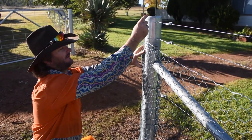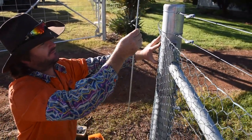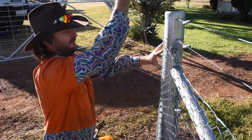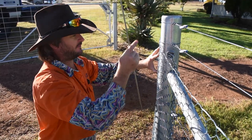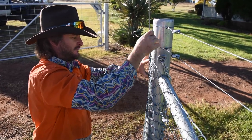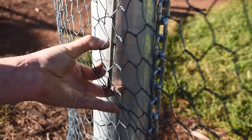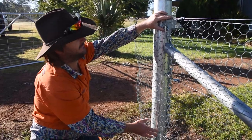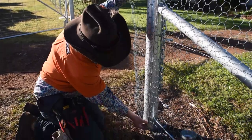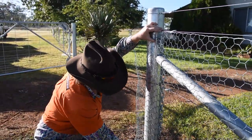We're going to get our threaded rod and Dave's pinned it up so the netting's flowing neatly. We've got a slight fall in the ground here so we're going to make our rod vertical, so it's not necessarily going to go through the same strip of netting all the way down. Just weave it through like this. We're checking that our rod is vertical and sitting at the top support wire and the bottom support wire. These were cut for 900 high netting and this is 1050 but it'll still work.